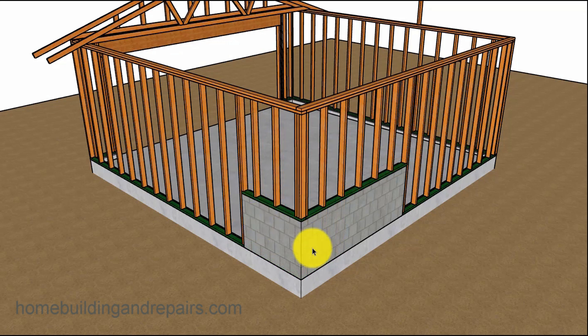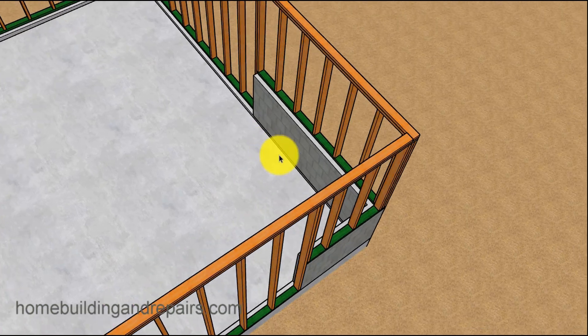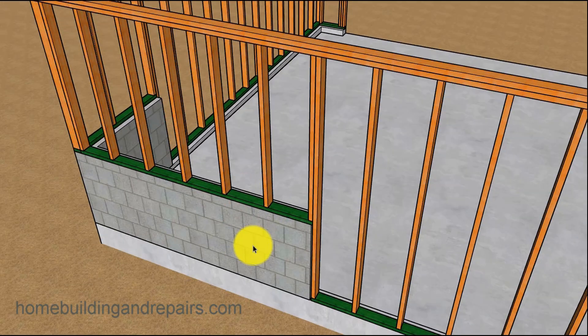Now let's look at another situation where we have a block wall corner. If that's the case, this is going to be a lot stronger. It all depends on how the block wall was built — brick wall, whatever you're dealing with. If you walk up to it and you can move this side or that side, you might need some additional support. If you can move it at the corner, you might need to just remove the block wall. Here we have framing going over a block wall that goes all the way around the building up 3 feet. Hopefully the wall has rebar and concrete in it — some type of cement-based filler to make a stronger wall — but that's not always the case with older homes.